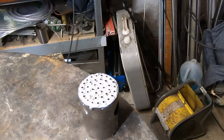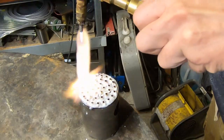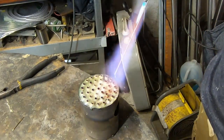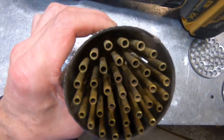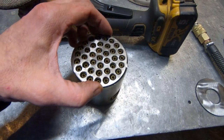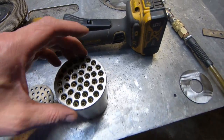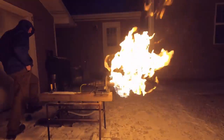It did take a little bit to put it together. When you're working with this many parts, the best thing to do is braze. I'm using a 45% silver solder brazing on this — about $12 worth of brazing rod to pull this job off, but it was well worth it. I'm using an oxyhydrogen gas modified with propane to pull this job off, and it did brilliantly. This is pretty much what we ended up with — real nice looking little laminar flow tubes. These are where the propane gas is ejected into the system. And this is our Venturi shroud that allows the air pressure to pull a subtle vacuum on those tubes so they don't inhibit the low-pressure gas output no matter how high we turn that blower up.